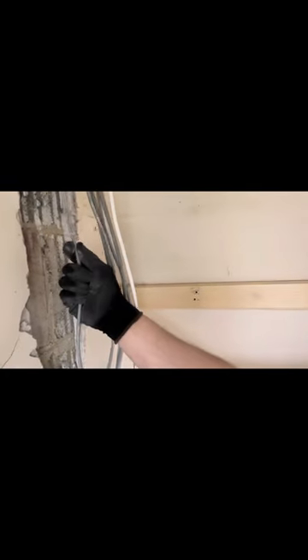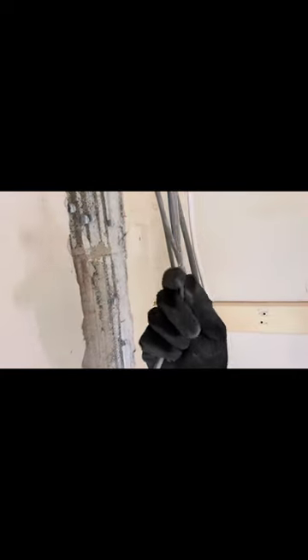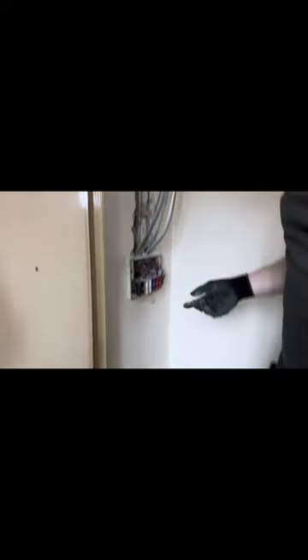I have tugged on it a little bit. It looks like it's missed the neutral - looks like the black is just on the grey sheath. All up to the ceiling I've just notched out that joist at the top there. I'm going to pass the cables through and then down here I'm going to put 100 by 50 trunking down and mount the board just above door height at the top there.